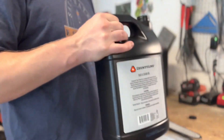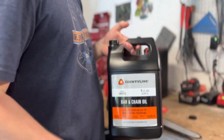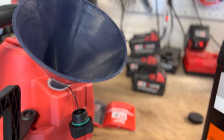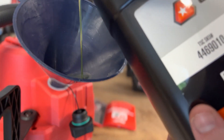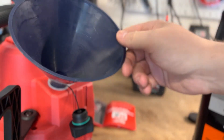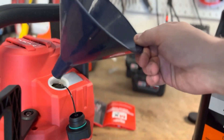Now since this actually comes with a chain, I'm going to save the one that I bought for later. We definitely want to make sure we have plenty of bar and chain oil inside the unit before we start anything. I have mine all set up here — put some oil in there, and it doesn't take much but you want to make sure that thing is full.